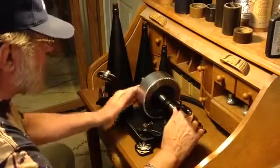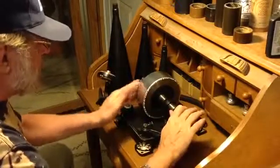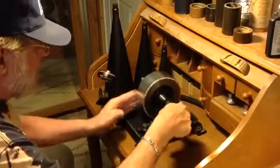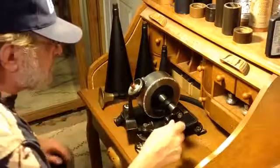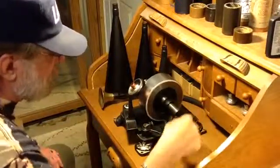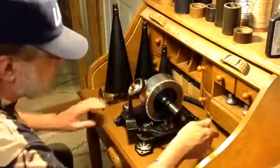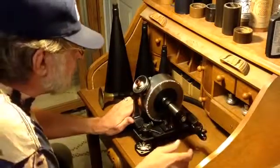So I'm going to record with the speaking tube and see what kind of recording we get. I'll be playing it back through a 14-inch fiberboard horn. As I said, these horns are really light, so using a standard witch's hat horn, it's so heavy that it actually tilts the stylus away from the foil and makes a soft recording.